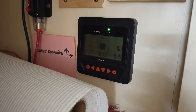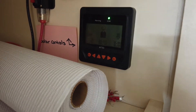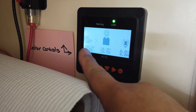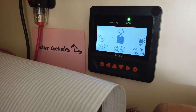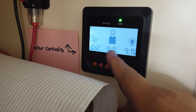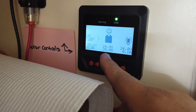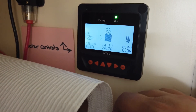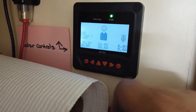To keep myself from having to go underneath and program the solar charge controller, we installed a remote meter. Right now it shows we are at 58 volts on the panels up above and we are charging at 8.7 amps. That is dropping down to 24.8 volts, which is where my batteries are sitting right now. At 20.4 amps — it goes dark a little bit to save power. We go up to 24.9 volts and that's the cutoff.